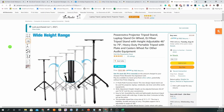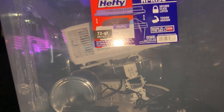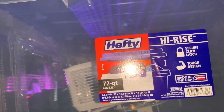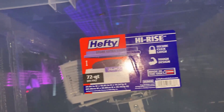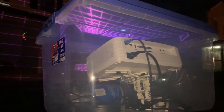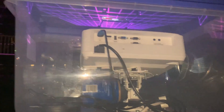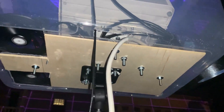Here's the final setup in action — it does the job. I'll admit it's not the prettiest, but you can decorate it to match your theme. I'm personally just going to put a piece of cloth and give it eyes so it looks like a big shapeless ghost, but you might have better ideas. A couple of required accessories: a media player so you can play files without a laptop; for sound, use an external waterproof speaker placed outside so speaker vibrations don't shake the projector. I'd suggest against Bluetooth because it usually has a two-second delay — just use an aux cable. You may also use an FM transmitter for people sitting in cars.